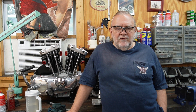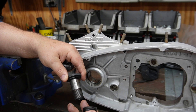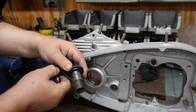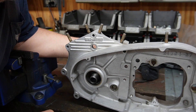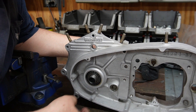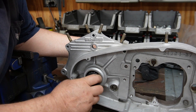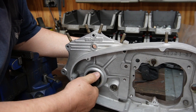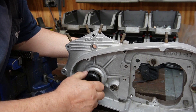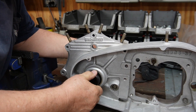You've got a new Timken race on one side, a new pinion race on the other side — it's just prudent to line lap them a little bit. Here's the tool that holds the lap in alignment with the Timken bearing. You put a Timken bearing on this tool, put it in the crankcase, put the other Timken bearing, and tighten it down. You can tighten it to the point where it doesn't rotate, although that's difficult to do.